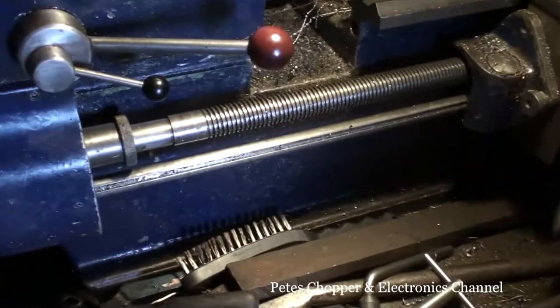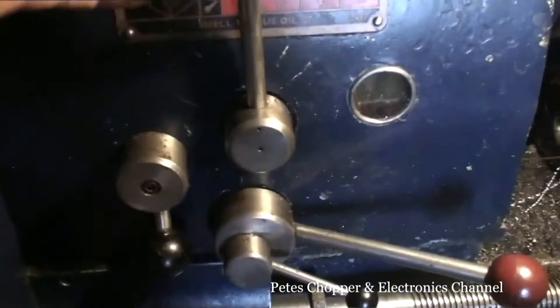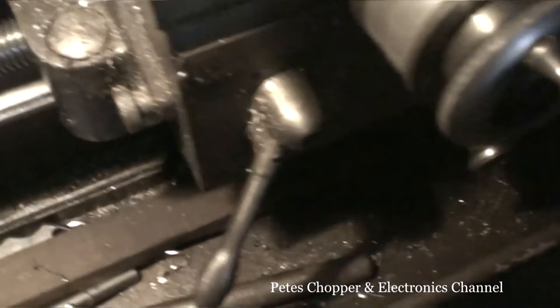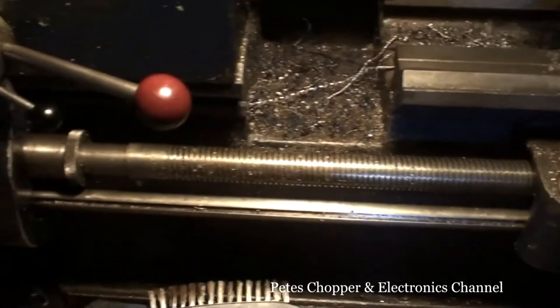So no matter what I do, this is before the spindle. This is the drive to the spindle, you see. So any gears I change, it doesn't matter. What I mustn't do is take him out of engagement here, or I'm really going to mess it all up, you see. Which means that I can reverse the motor. Actually reverse the motor here. And drive him backwards and come back again. But as long as I don't disengage that one, I'm okay.